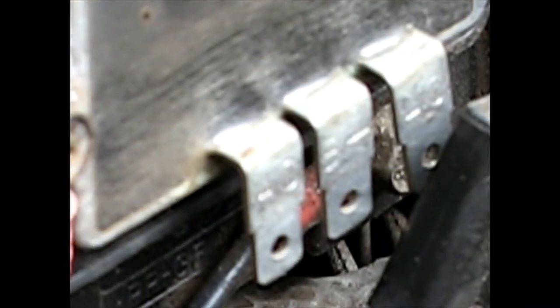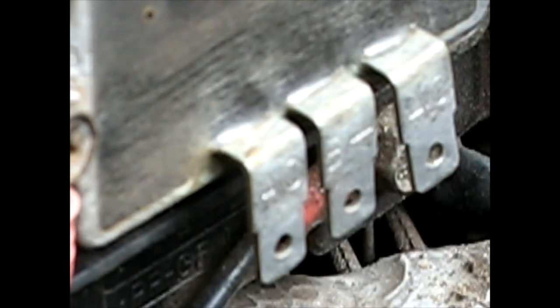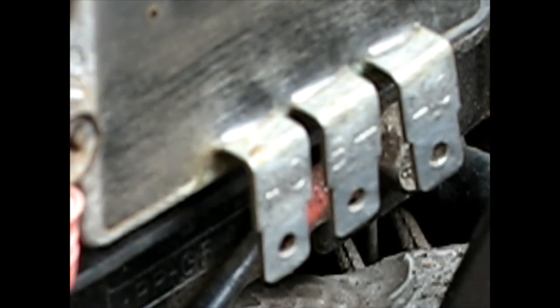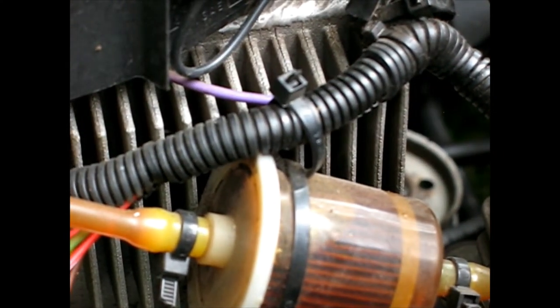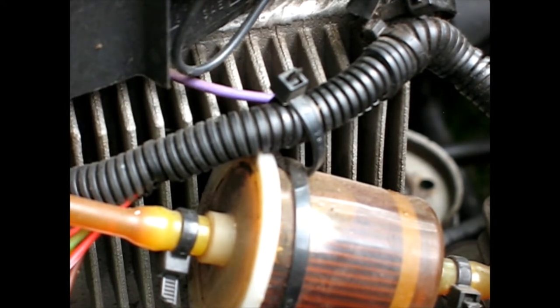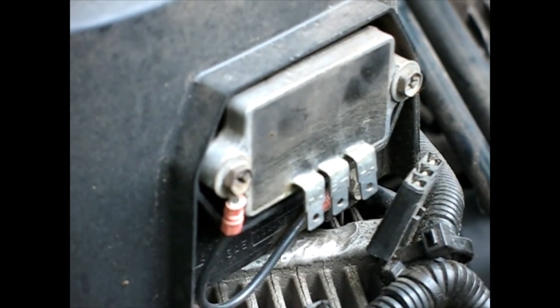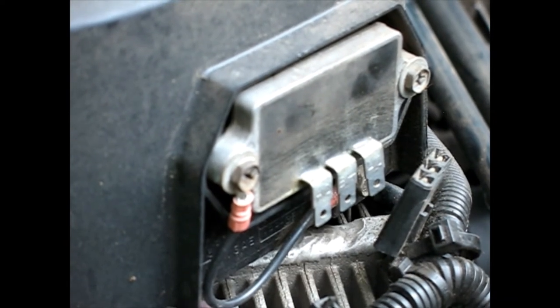The terminals are marked AC, AC - and one would have to be going out, so that's got to be DC going out in the middle, then AC, AC, DC going out. I'm going to clean those terminals. AC, AC, B-plus - so battery plus. What's interesting is it comes out on a purple wire. Purple wire disappears down into the engine - why wouldn't that be heading right to the battery? Also, this is a heat sink here. Oh wait - that's related to this oil filter, it must be an oil cooler.